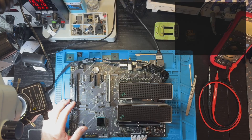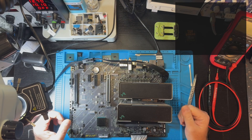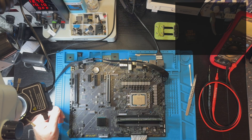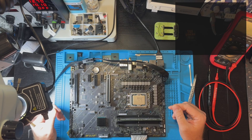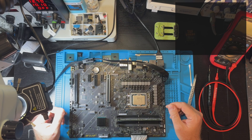The motherboard will go through stress testing to make sure all ports are functional and the system is stable, but reaching this point means the hardest part of the repair is already done. The repair was successful in large part because I had access to the board view — with it I could see the exact resistor values, identify signal names, and verify missing components, which was critical for tracking down the fault. What's puzzling is how those components were knocked off in the first place: they were located in two different areas of the board, yet the PCB itself showed no scratches or other signs of damage you'd typically expect from a screwdriver slip or mechanical damage while mounting the board.